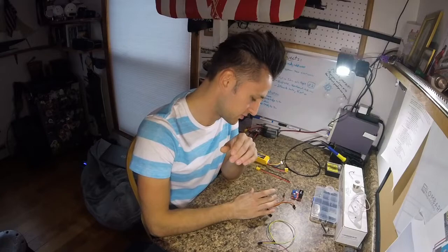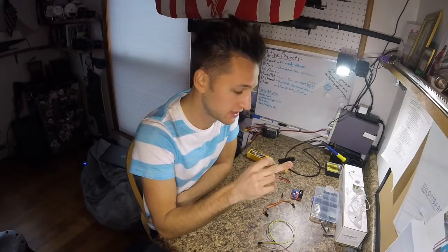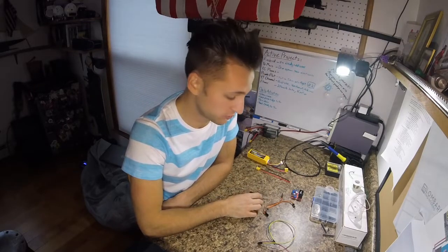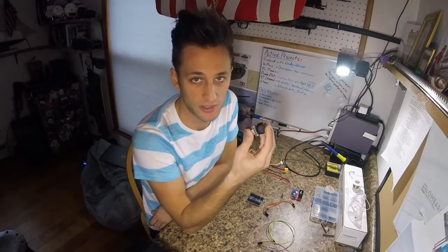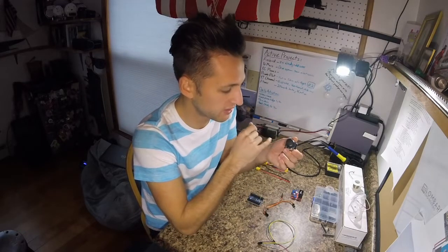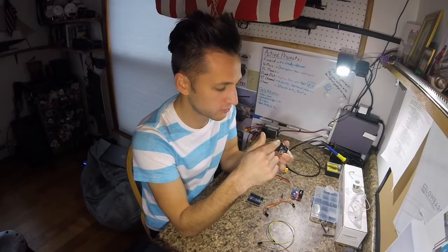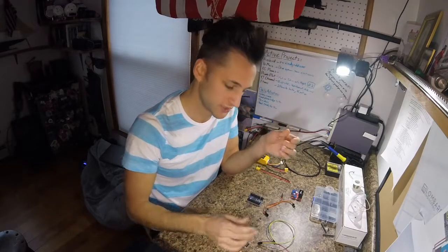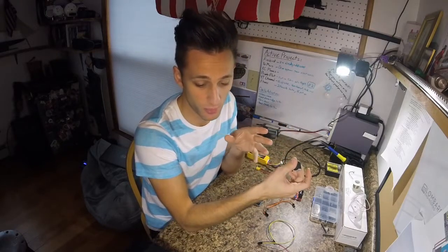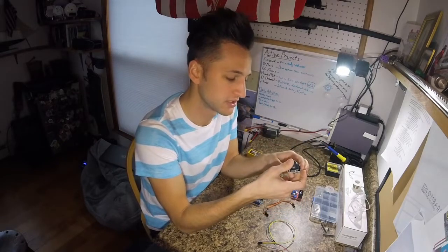To rectify that I have an Arduino Mini Mega — it's not actually an Arduino, it's a Chinese knockoff, but it uses the ATmega 2560 chip which is great because you can use the Arduino IDE. The input to the Arduino Mini Mega is going to be our analog joystick. These just have ground, 5 volts, and then two potentiometers inside that output 0 to 5 volts in two separate channels depending on joystick position.